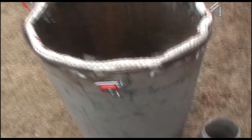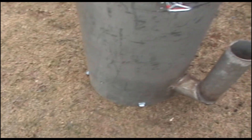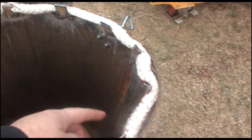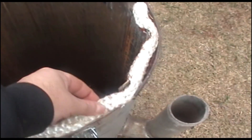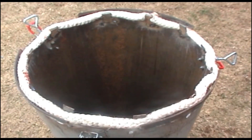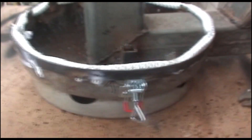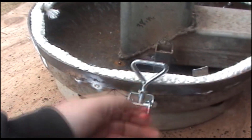I've put on my clips - three on the top and three on the bottom to hold the cylinder down. I've welded in some lugs. This stuff here is what they use on wood stove doors to seal them when they close - that's what I'm using to seal my top and bottom. I've finished the bottom of my heater with the clips on and the sealant cord in.